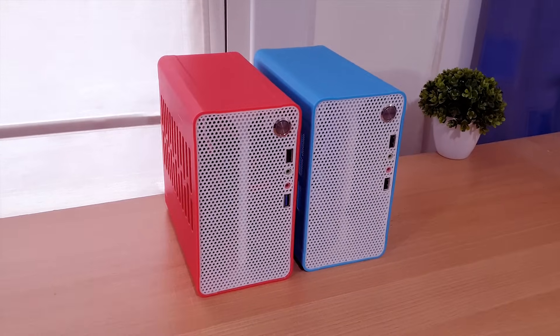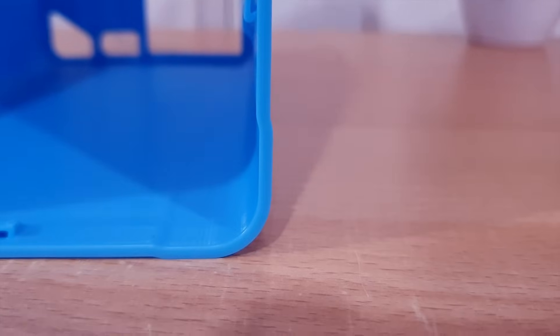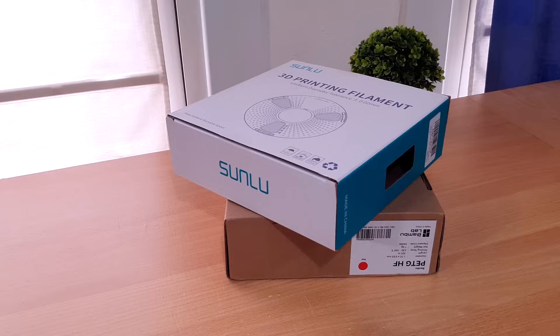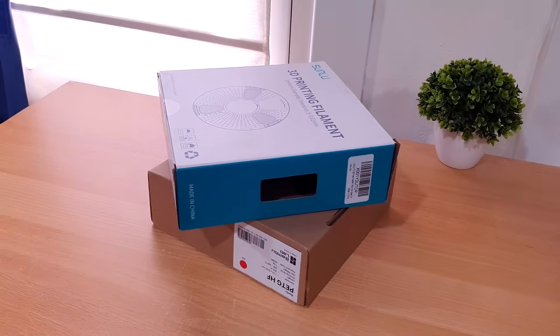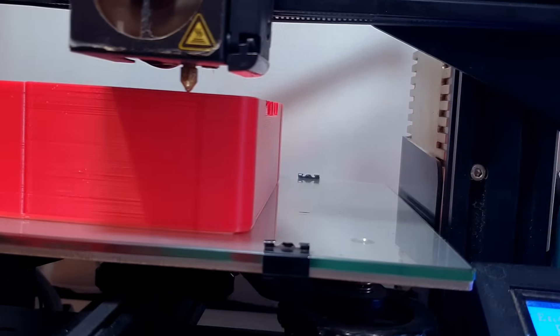I got two near-perfect cases out of it. Something interesting to note: going from a 0.6 to a 0.8mm nozzle makes the walls a third thicker, not a quarter like you'd expect, and this is reflected in the weight. It's been a bit hit and miss with this filament — both brands seem to have sent me bad rolls. I gave the Bambu another chance, ensuring it was bone dry before printing, but it was still the same.